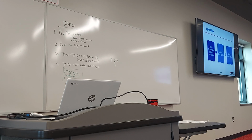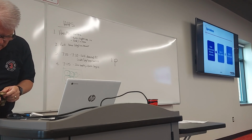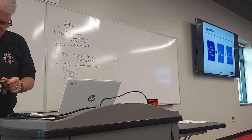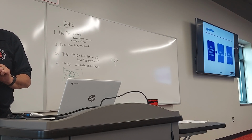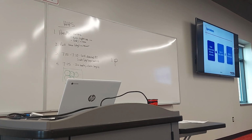All of the stuff in the middle is a heat collector. And it will collect heat up to a point, and at a certain temperature, that middle part fails. Okay, and if you look at your sprinkler, you will probably see a temperature on there. This one I don't see it, but it should be somewhere. But instead of spending too much time, this one says SSU, standard sprinkler. It's been rated. U upright, P pendant, S sidewall. So SSS, standard sprinkler sidewall. SSP pendant, SSU upright.